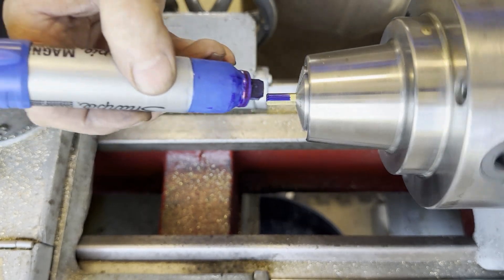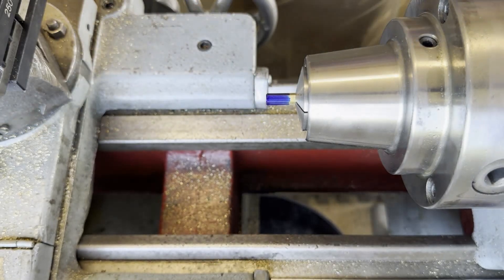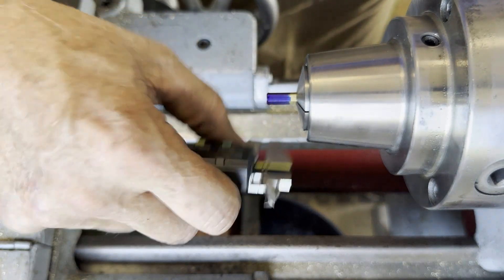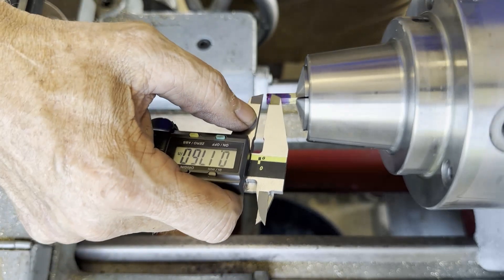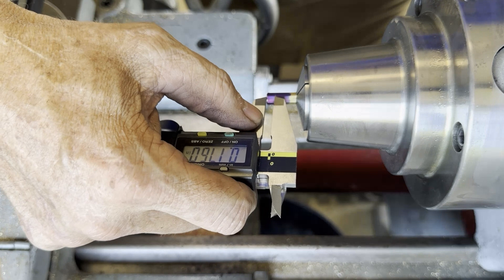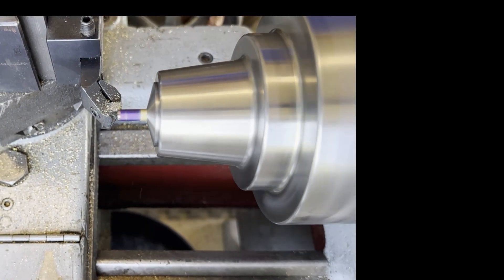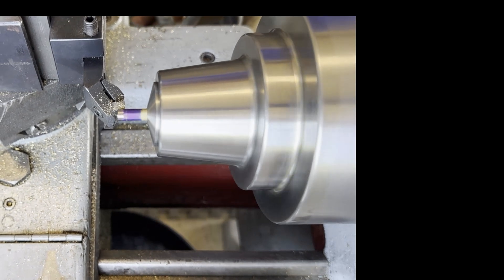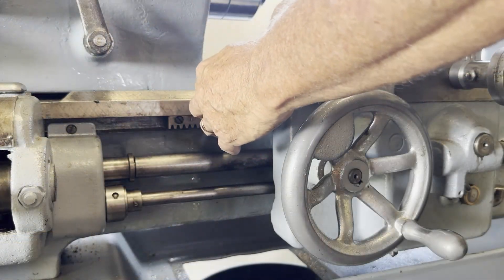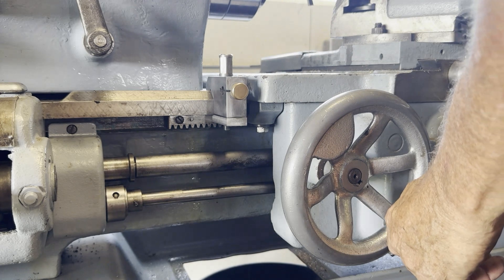The cap is made from quarter-inch hex rod in brass. Sharpie it up. The only difficult part here is you've got to thread a little small nub — and I'm using my good calipers to mark this. That brass shouldn't hurt the hardened steel. Now we're going to bring this down to size — it's going to get a 10-32 thread pattern on it.